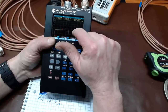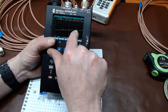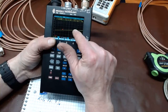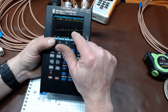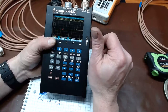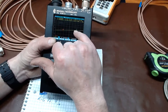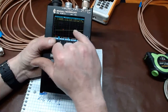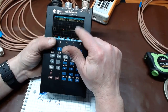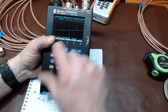Okay, now you can actually look across the span. Right now, I've got from this arrow here to here, we're only looking at a couple of megahertz, from 25 to 27, 27 being the principal frequency that we're looking at, 27.402. So looking at that, what you're actually going to be able to see is how far a span you've got based off of your phase angle. So that's something that you can go into another screen and we can actually see that as well.